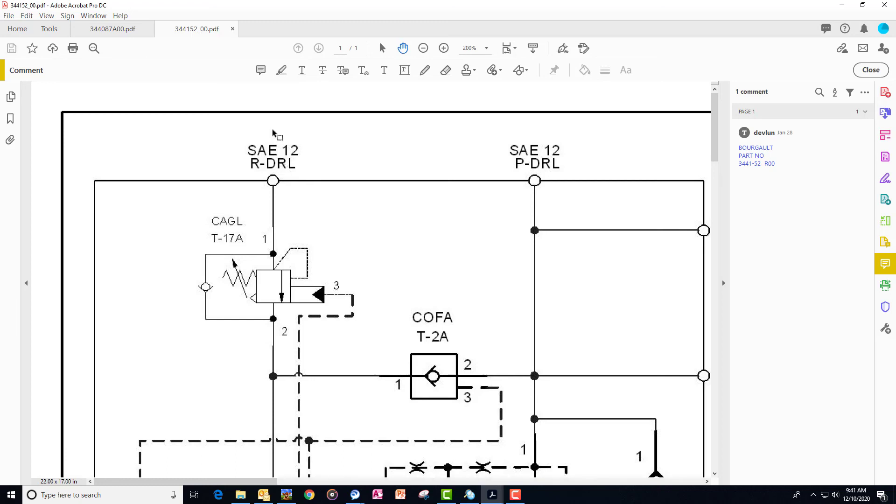So we could have the same problem on the circuit where you'd have rod end oil migrating over to the base end of the cylinders or the circuit. The only difference is this counterbalance valve is holding it all at roughly 2000 PSI.